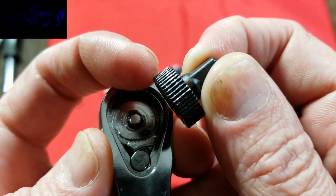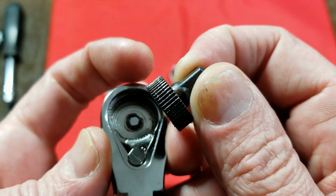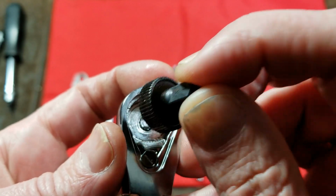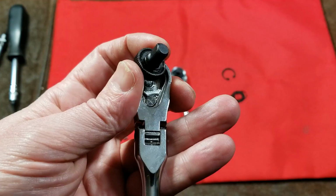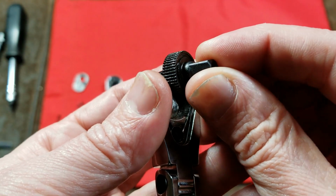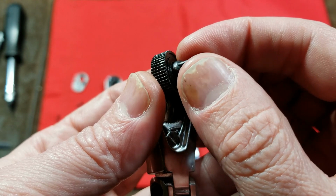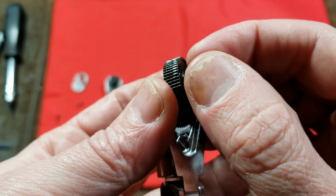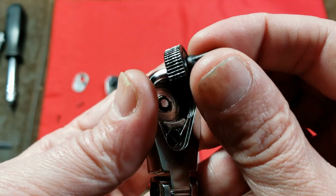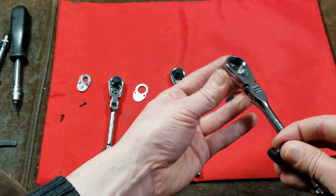And you can almost see that because there's more wear on the inside here where it's shinier than there is on the outside edge, just because of the way it's rocking back and forth and isn't maintaining as precise an alignment. And just like any other gears, if you have a pressure point on one side, it's going to wear at a very accelerated rate. And then as it wears, there's less overall material remaining, and that remaining material will also wear down more quickly than if it was all evenly aligned to start off with.